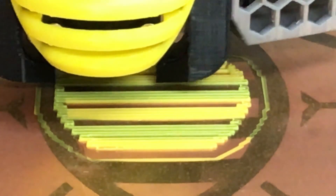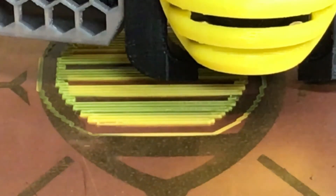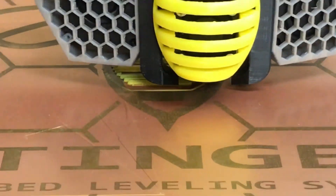If you look in the upper right-hand corner of the cover, you'll see the CR-10 end switch up there. We have a mount for it and we sell the inductive switches — the 8mm induction switch — and it comes with a metal plate you'll attach to the top of the chassis for the inductive sensor to sense. These are very accurate. Contact the sales desk if you're interested — it may not be on the website right away, but just know that it's available. Also, brackets for capacitive or inductive systems — we can set you up with the STL file so you can add that to your system if you wish.